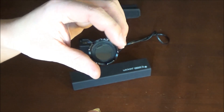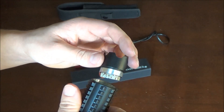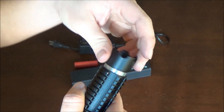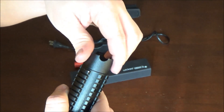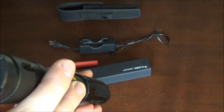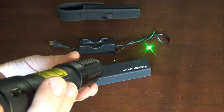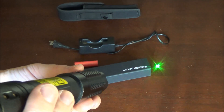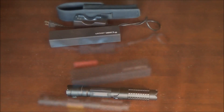On the very top of the laser you guys can see that little hole that the light actually passes through. Inside of that hole there's another little tiny glass lens — the first lens that the laser passes through — and what I suspect is that the original owner who didn't use the safety lens all the time either got a little particle of dust in there or maybe even scratched it somehow. But I haven't really seen it affect the beam strength or the burning power at all, so I'm kind of just leaving it alone to avoid further damage, and that corrector really seems to fix the problem altogether.